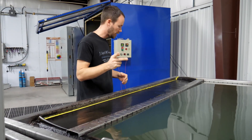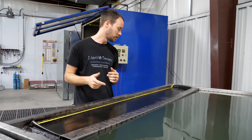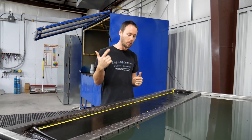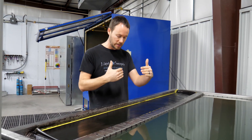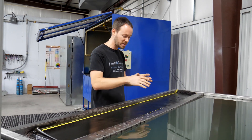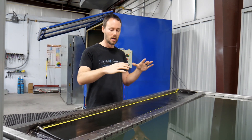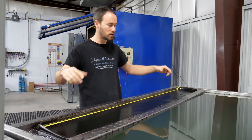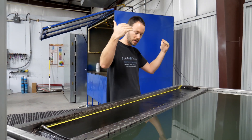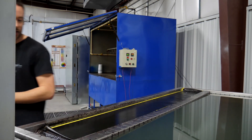Now we'll go for round two — get the other side dipped and then show you guys how it comes out. As you saw in the first dip, it came out really good — one nice smooth fluid pass all the way across with the activator. One thing to remember is that we did put tape along the longer sides of this. You don't have to, but because this film — specifically the CF-282 — on very long pieces it does want to roll up sometimes. So we went ahead and made a small tape border just to make sure it didn't roll up when we sprayed the activator.